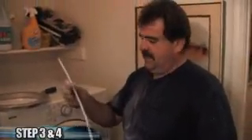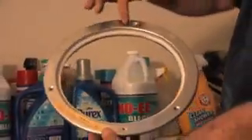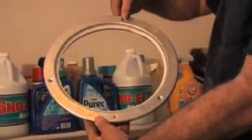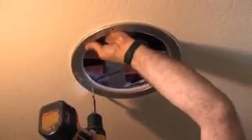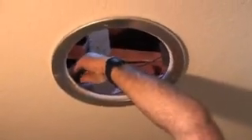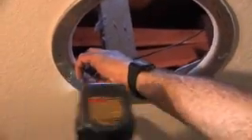We're going to take the white gasket now and put it inside the trim ring — peel back the paper backing. Take out three screws and three speed nuts. The ring has six holes in it: three larger ones and three smaller ones. The larger ones are recessed and countersunk — these are the holes that we're going to put the screws through. We screw the screw through the drywall, take the little speed nut, lay it over the hole, and drive the screw in.